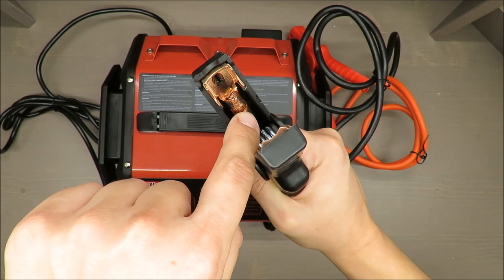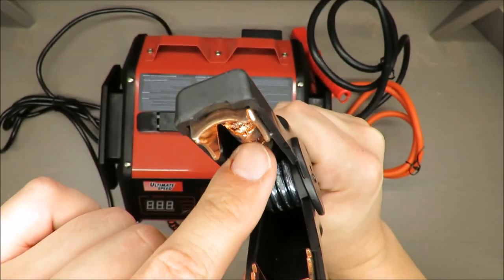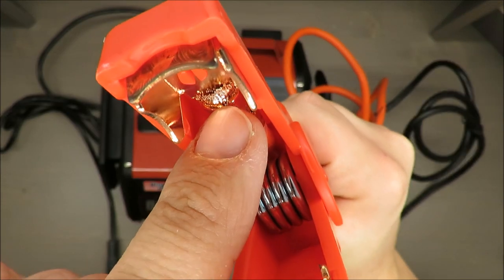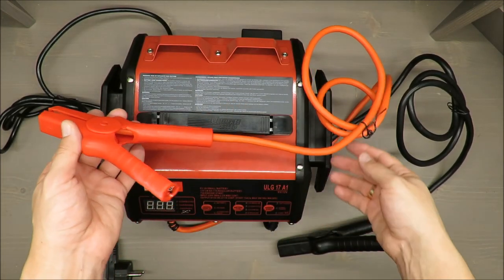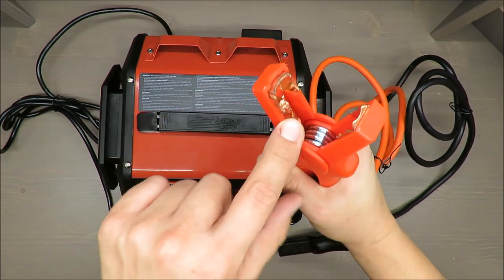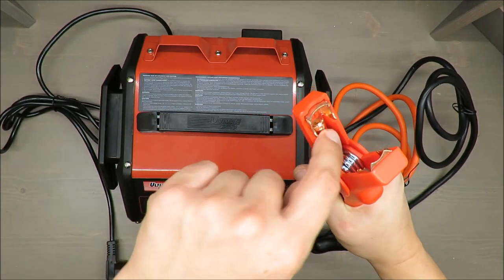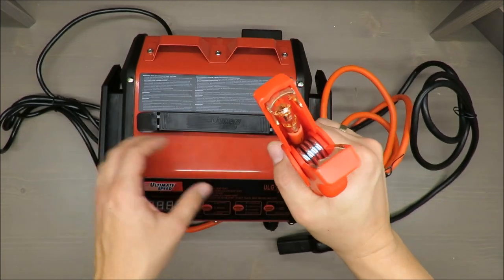On the plus side, the cable is quite nicely bonded. But here you might think it's copper, but it's aluminium for sure, or some other alloy, but it's for sure not copper, because it's silver here. So in my opinion, the quality of those cables looks better than it is in reality. And again, no connection. I mean, it's cheap, and if you decided to buy it, please make some kind of connection between, because it will add some efficiency.